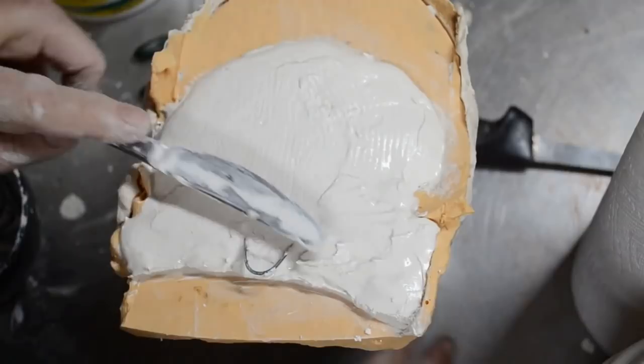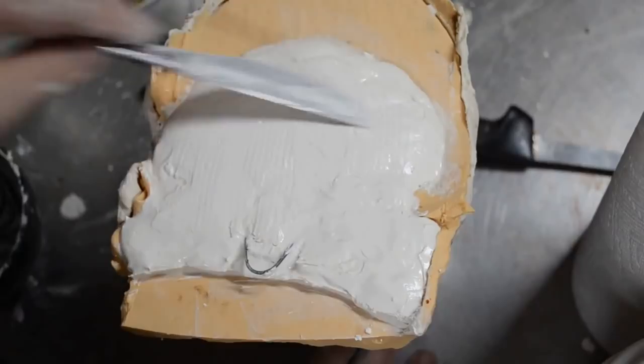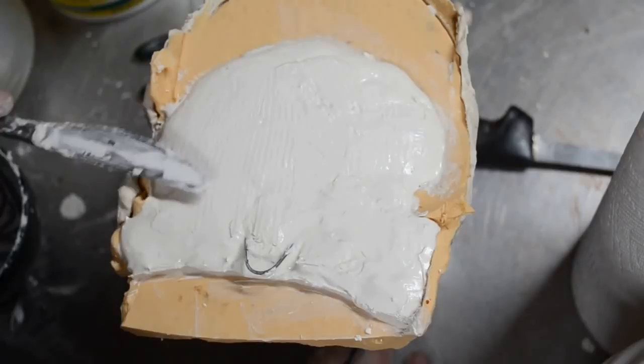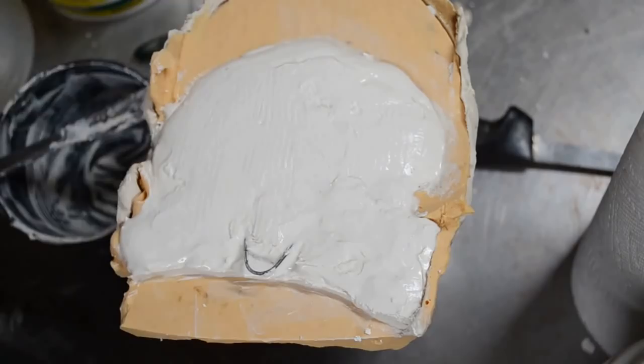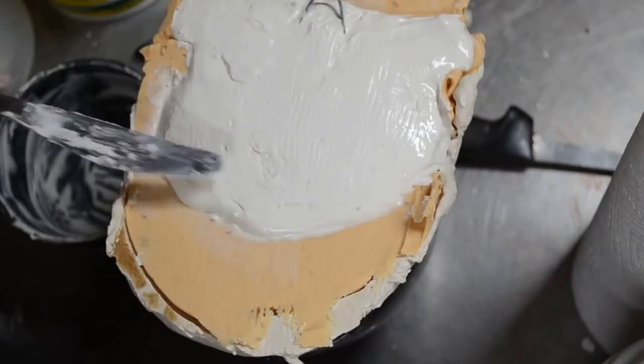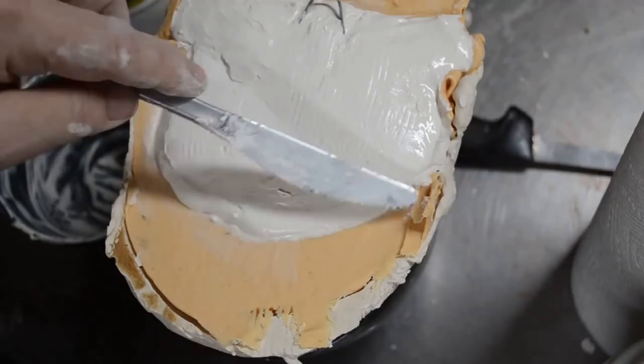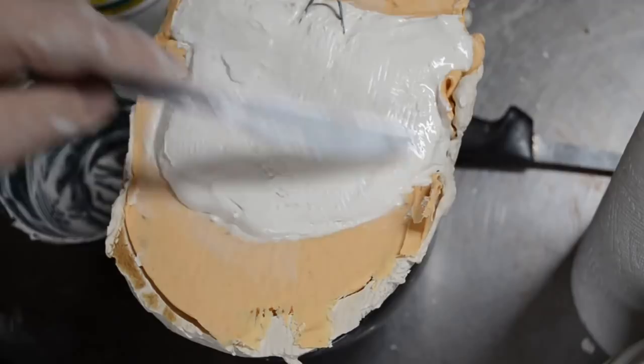Okay. Now, this second pour of plaster was made much thicker than the first. So this will ensure a good heat buildup for it to set. And the heat that this generates for this setting will also help firmly set the thinner stuff. That's going to take a while to set. I may not demold this for a couple of days, because you can see as I press the stuff on top, I'm getting a little light disturbance here from the stuff that was already in there. I'm trying to blend it together to help it all set.